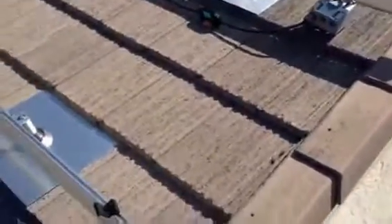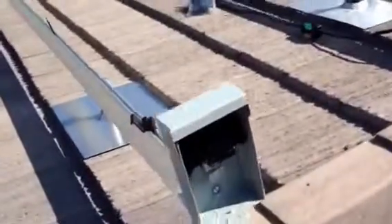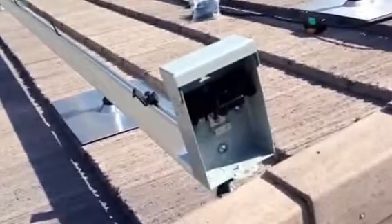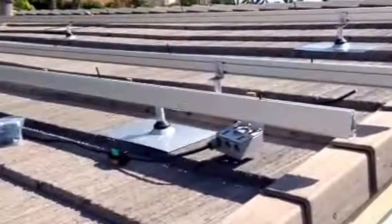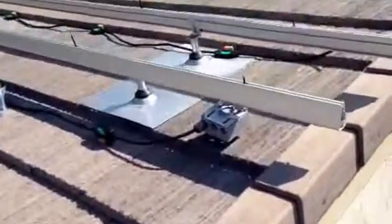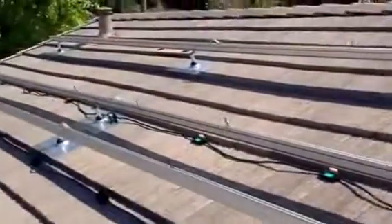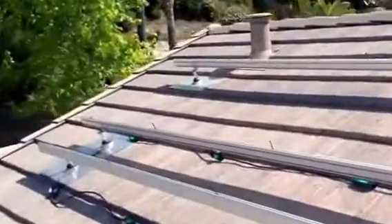I have mounted a couple of electrical boxes and am mocking out how I'm going to lay out the Enphase cable. This here is a pull switch box — the local authority required a disconnect on the roof, so I'm using that. There's also a two-gang bell outdoor box mounted there. You can see the Enphase cable coming out of that, with a string going across the roof, down to the end, doing a U-turn, and coming back along the upper row of the array.